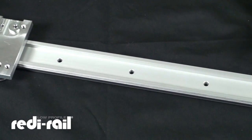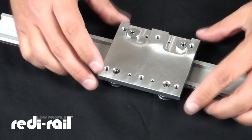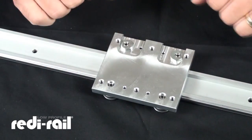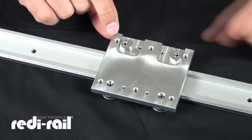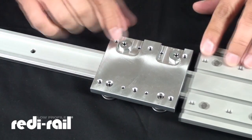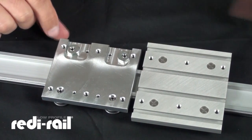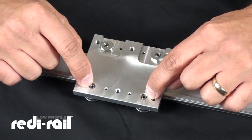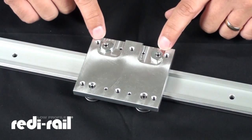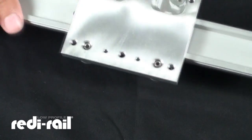There is no adjustability, so over time with wear and vibration you can't take any play out of the system. These are often used in applications where you can't get at the slider. But for those applications where you can and you need some adjustment, we have this version here that's just come out for the low-profile. You'll notice the height is the same — 19mm — but on one side we have fixed bearings, while the other side has bearings mounted on eccentric adjustable cams.